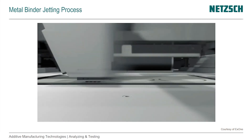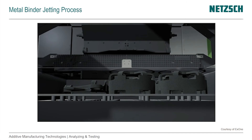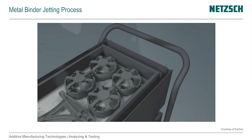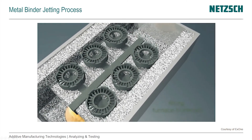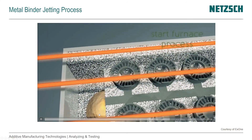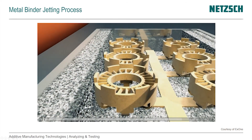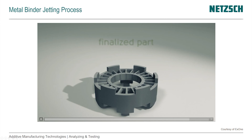This is done really quickly because we don't have any fusing happening — it's a bonding process, we don't need to melt anything. The parts are taken out of the powder bed and depowdered using a vacuum to remove the loose powder. Then they are built into a chamber with a runner system that can infiltrate six parts at a time. It's heated inside that mold, and through the animation we can see how the metal infiltration works through the runner system into the part. Finally, we let it cool and we have the finalized part.